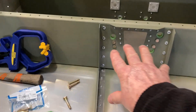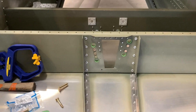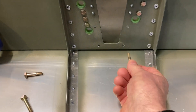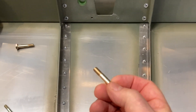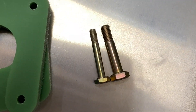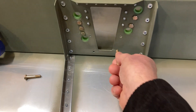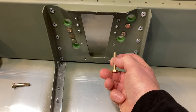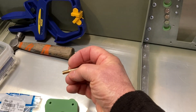Full disclosure — when I was doing this and setting it up, I was drilling out these for the A6s because they wouldn't fit with just a clearance drill. Without thinking, I thought these were rivets also and drilled those, which take this AN312, and now it rattles in there quite a bit and I don't like that. So I bought a set of AN412s and, believe it or not, the shank or grip on them is just a hair less than the AN3 when you line them up — literally one millimeter shorter. So I'm definitely going to size these up so they'll be tougher, and I'm putting them through this way so that I have a solid grip in the aluminum. If I went the other way there would be a hair bit of thread stuck in the aluminum, so that's why you'll see them this way with the nut — I don't worry about one little half a thread in nylon.